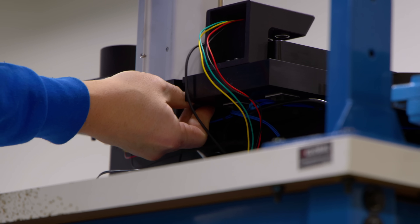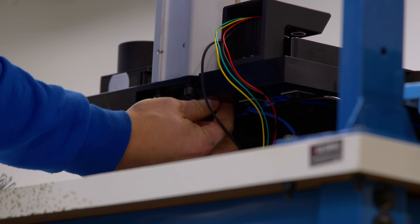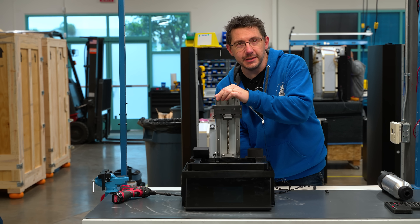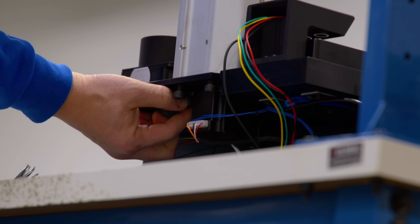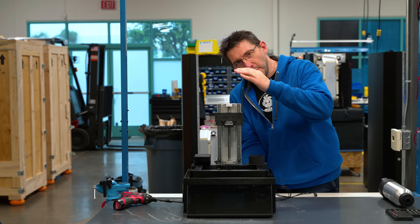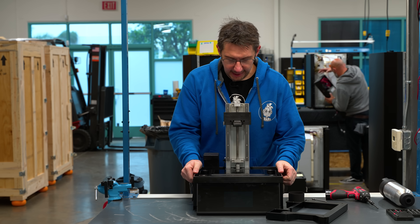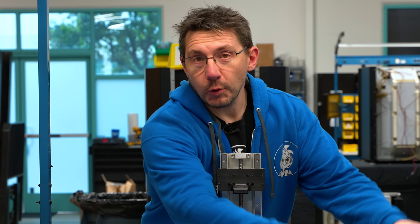Four big bolts go in from the bottom. Part of the reason we do this is for the rigidity of the machine. When we're talking about the leveling of the build plate, you also have to remember repeatability. In an industrial environment, having it stay level over many, many cycles is very important. Having a nice, robust Z-axis helps ensure that the build plate level will be consistent over use. From the factory, Nexa is going to calibrate the Z-axis, and with the rigidity of the machine, they know this is going to last for quite a few cycles.